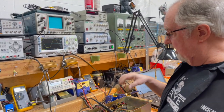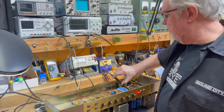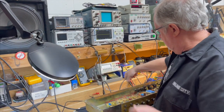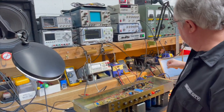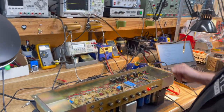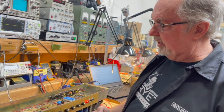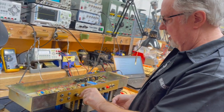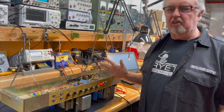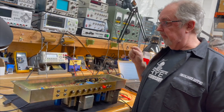However, what you are going to hear is probably more power supply noise, because it's a noisy power supply, and in this particular amp, they're known for being kind of obnoxious in the ground department. So at 90 volts here, when we're variacing this amp by turning it down to 9, we're trying to get everything to saturate. By doing that, we need to turn the volumes way up. By doing that, we really start to expose how much hum there is built into the power supply that the deliverance doesn't have, because the deliverance has a power supply that's filtered better than this.